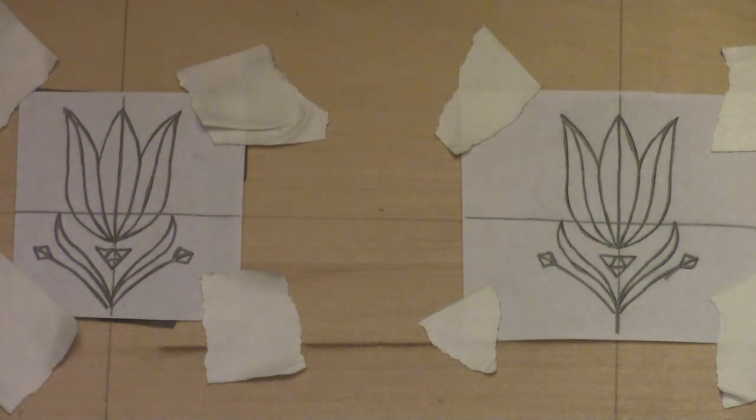I find that when I shade the back of the design and trace it onto the board, I'll go back to the board with a pencil and trace over areas that were too light from the transfer. And before I do the tracing, I'll take a piece of tissue and rub the back of the design to remove any loose graphite from the pencil I used to shade with. It prevents excess lead from smearing or embedding into the wood.